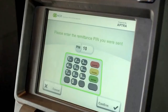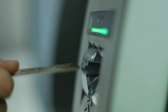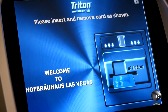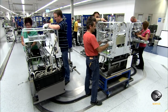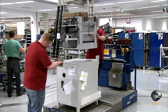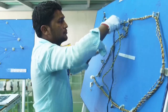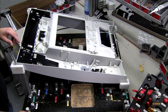These parts are put together to make the internal structure of the ATM's head module. Assembling the parts: all these products, including the power unit and the ATM computer, are assembled by workers in the factory, who then lower the head module onto the ATM's steel safe. The safe has walls up to 2 inches thick, and the operation panel is aligned and assembled inside. The panel is placed at the front of the head module and contains everything used in an ATM transaction, including the card reader, the keypad, and the speaker system.